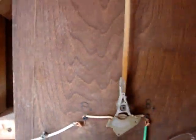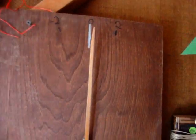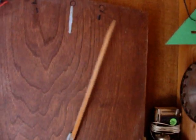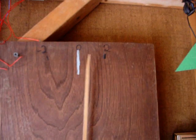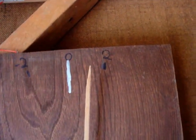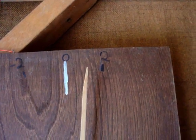To give you a quick demonstration on this, I normally hook up the battery charger or something of a known amperage that's going at the time. You can hear the AC ripple in it because it's kind of acting like a speaker. Right now I'm actually putting about one amp in here. It doesn't take much to move it off zero.